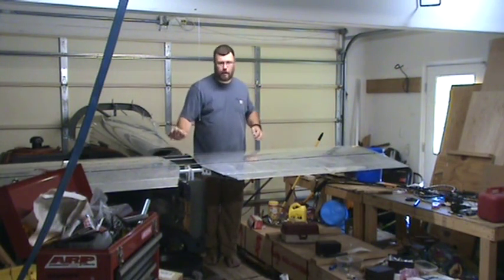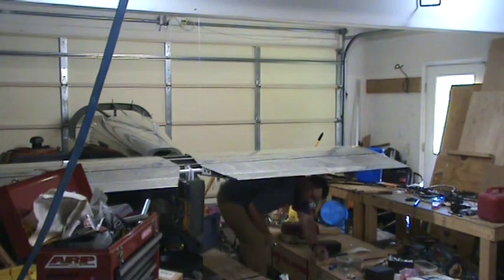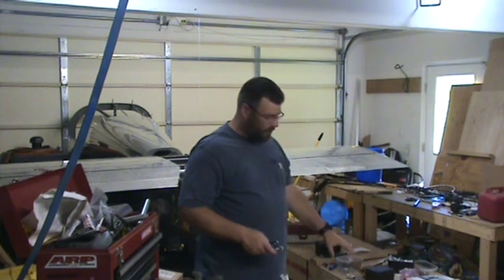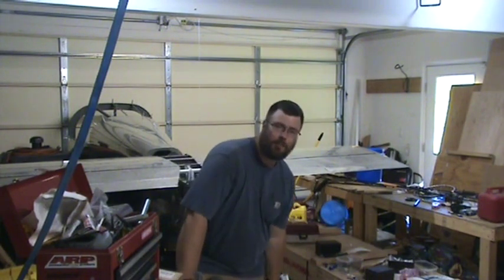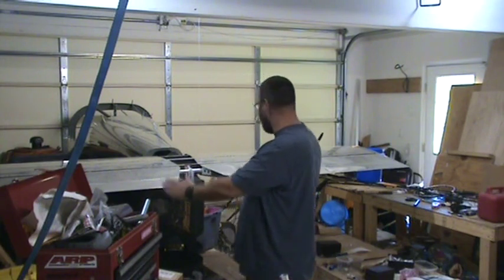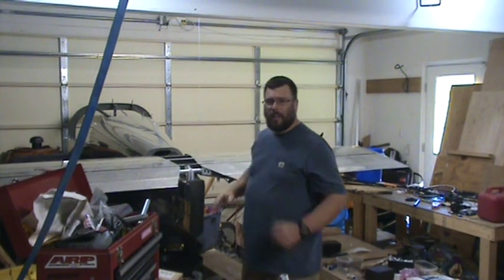And quite honestly, I planned on showing exactly what I did. And it's quite hard. I'll probably use some picture captures out of the manual and discuss what I did exactly in another video. But basically, it was get both of these to match in the down position. Run them up until the right one is level and check if the left one's level, and then adjust accordingly.